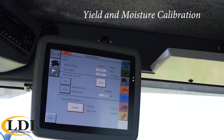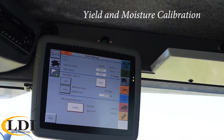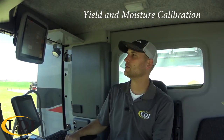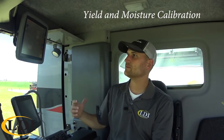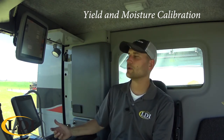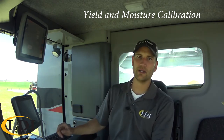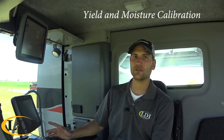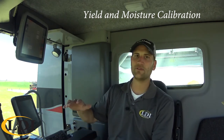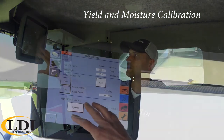The first thing you'd go to is your zero point calibration. Basically the yield sensor is a paddle at the top of the clean grain elevator and it senses vibrations to read yield. What you do is you kick in your separator and your header, run it to full RPM and raise your header all the way up. When you've got that going, you hit the update button and it basically zeroes out the calibration — the base vibrations of the machine — so that any vibration above that from grain hitting it will read as yield. You want to make sure you do that first.